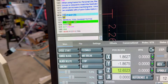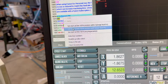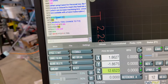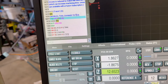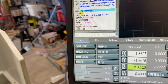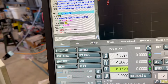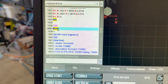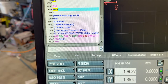No matter what I do - if I click and set start line, cycle start, it doesn't do anything. If I do start line with linear, doesn't do anything. With Z plunge, doesn't do anything. No preparation, start - nothing. If anybody knows how to start it in the middle like Mach 4 where you can just click and say start here, but I want it to know what tool I have in and spindle speed. If anybody knows how to do that with PathPilot, let me know. I'm thinking because M30 is in there, that means end the program, and when you start from anywhere in the code it still reads everything above it.